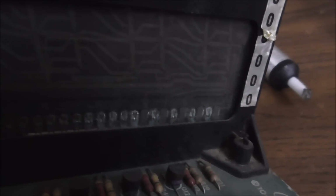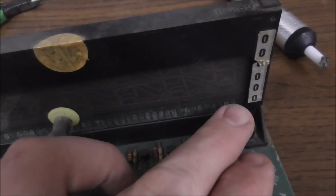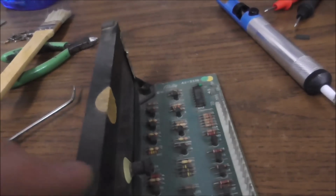The only thing that worries me a little bit is if you look at the back of the glass, you see the corrosion inside the glass on those pins. We're starting to lose these glasses, people. They don't make them anymore. But you see how that's discolored right there and right there, right there and right there, like a corrosion inside the glass. That's not good. And there's no way to fix that because the glass is sealed and has a vacuum. So it could be the glass.